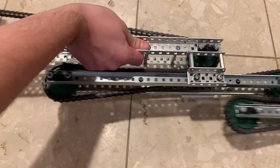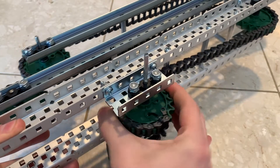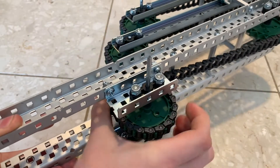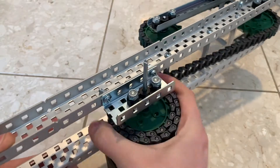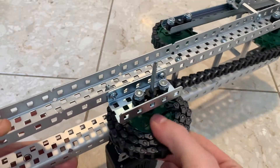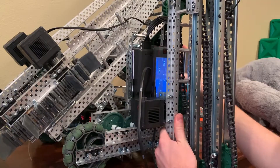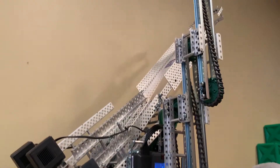You should see the stages start to ascend. Now that we have a working linkage, it's time to power it. There are several ways, but I'm going to go with a single sprocket at the bottom that's powered. This is by no means the best method, but it is a very simple method that shows how the entire linkage works. The end of the chain is zip tied to a sprocket set off the back of the base so as to not conflict with any of the other sprockets on the different stages. The motor is a normal 200 RPM motor, which simply turns this sprocket. The chain loops around it and the lift goes up. It has a bit of trouble coming down, but that's more a function of not enough weight on the lift and too much friction due to the VEX slides, but that shouldn't be a problem once an intake is added on.